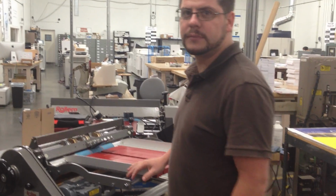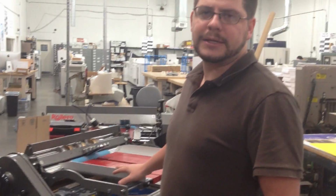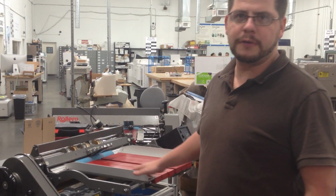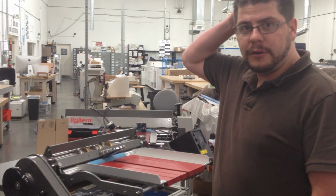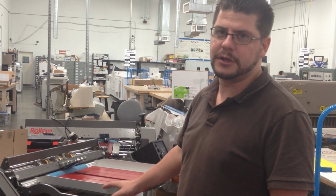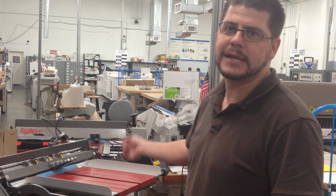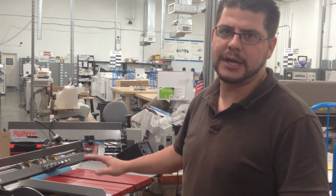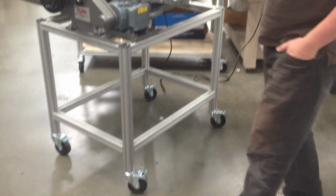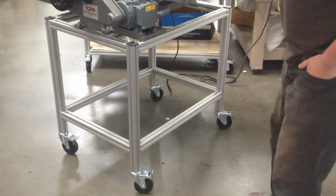Alright, we're starting? Alright, gonna make two videos here on the Rollem machine. This is the perforating machine. We've got 3 perforating wheels, and I'm gonna show you how to tweak the setup once it's already in place, and then we're gonna show you in the next video how to actually set up the perforating wheels to adjust. Always make sure that these wheels are in the lockdown position so it doesn't roll on you.